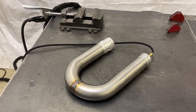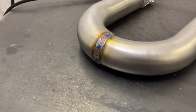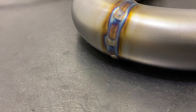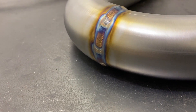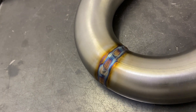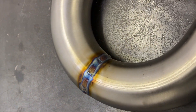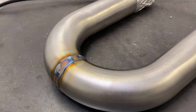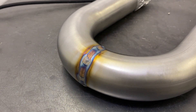Our mandrel lap joint is complete. Should we see how we did? All right, here we are. Once again, a very consistent cadence in terms of dips and consistently spaced start and stops. Good coverage, good color. I would call that a successful, strong, and attractive lap joint.